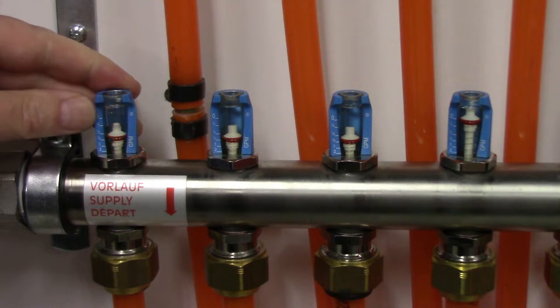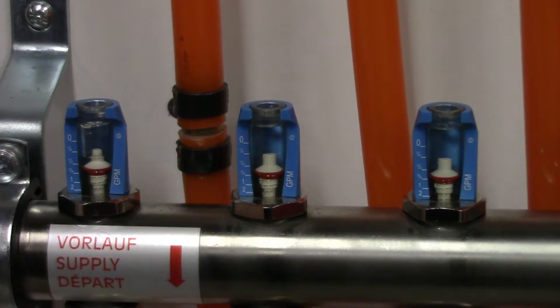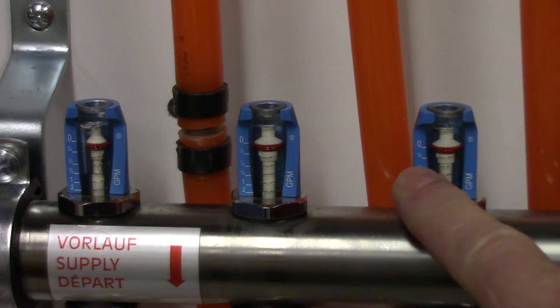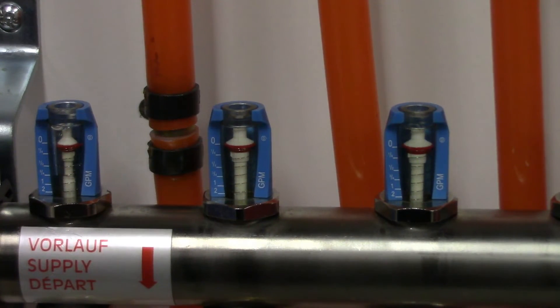They're all matched at just over half a gallon a minute. I'm going to turn the thermostat off and we'll see if this one is no longer stuck. Just waiting for those actuators to slowly close — and there they go, no longer stuck. That one's sticking a bit — might just be they're getting old. For what it's worth, if you've got one of these that are stuck, it's not really a big deal: just unscrew them, free them up, plug them back in, and see what happens. Cheers folks, have a good one!